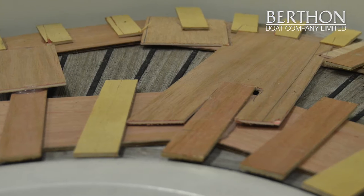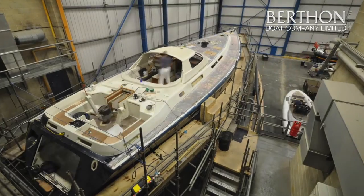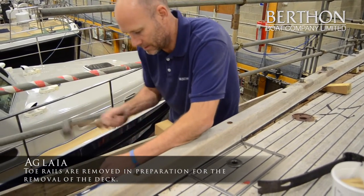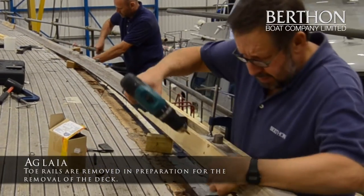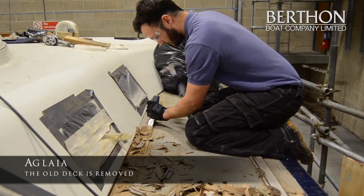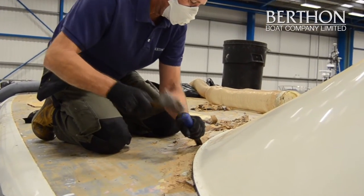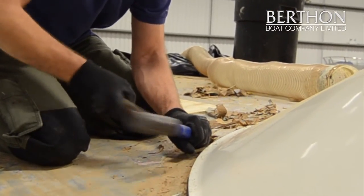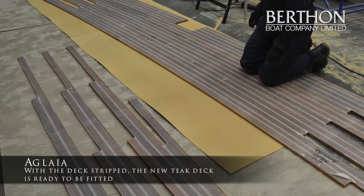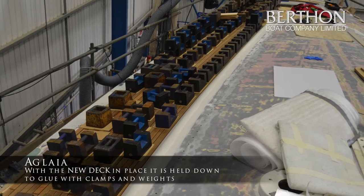Once that was established, we went ahead with a composite deck — basically the deck comes with a fiberglass sheath and a new deck laid on top, which comes as one piece. We routered off the old deck, prepared the surface, and stuck the new deck as one piece on top. The process really only took 6-7 weeks to replace the whole deck, which is a very fast process, and it's due to this deck being available in one piece that allows us to do this.